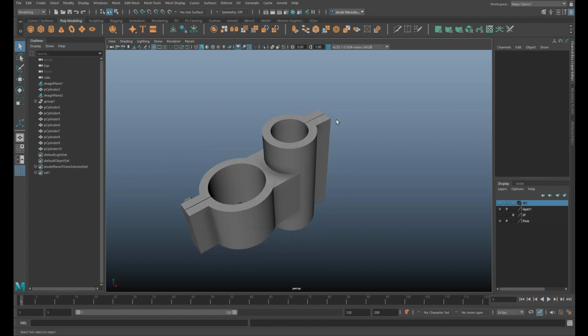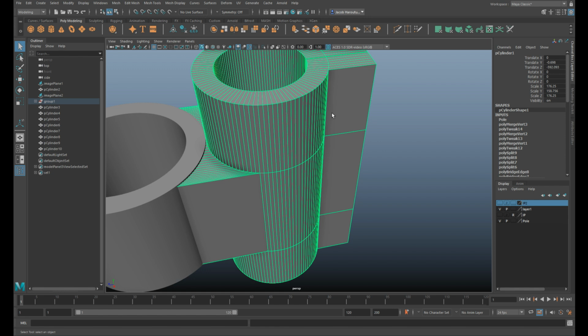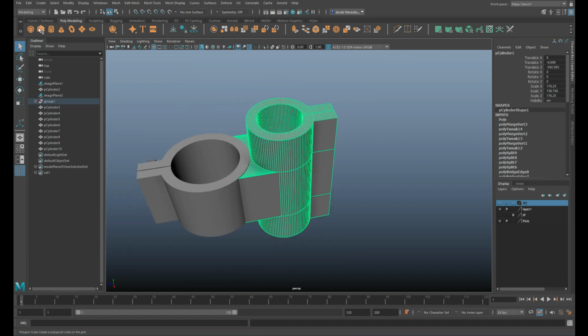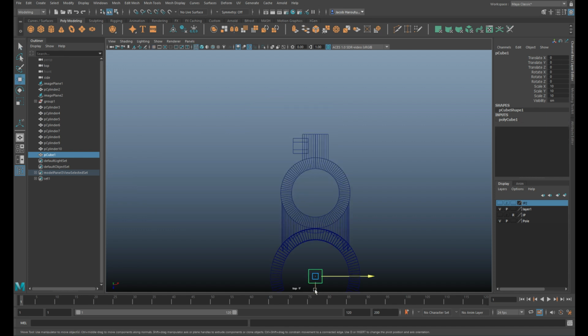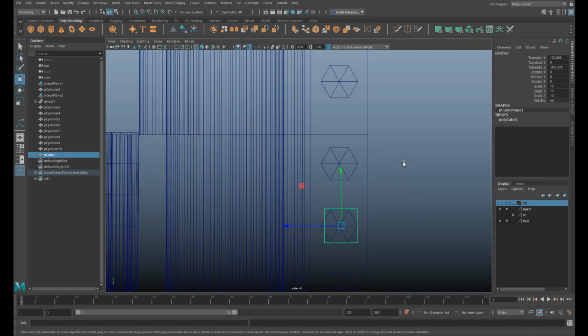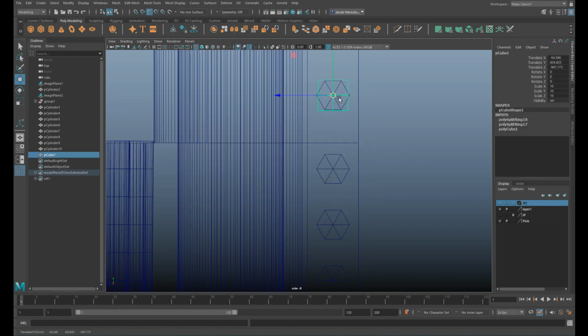But there's still one more thing we need to do. We need to create a hole for the screw to go through. So the diameter of the screw cap is 8.88 millimeters. As a matter of fact, it's closer to 9 millimeters. So we'll just do a 9.5 millimeter hole for those screws, or even 10. Give it an extra millimeter to sit in. And we want it to be able to sit in about 4 millimeters like the other side. So first things first, let's get this cube, which is the diameter of the screw cap, onto each one of these.